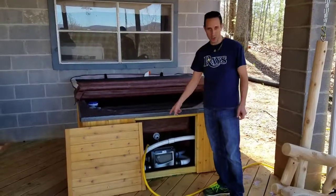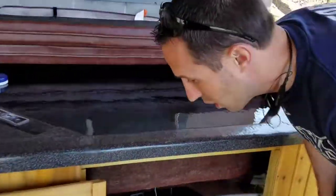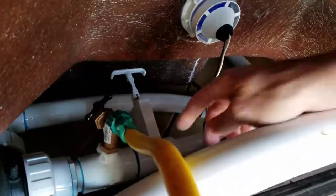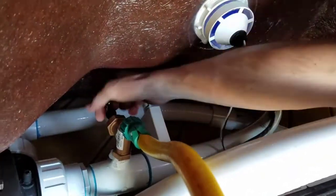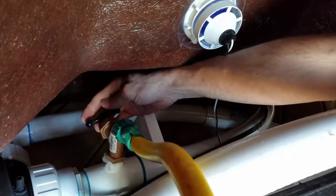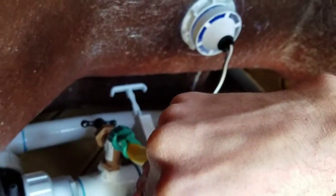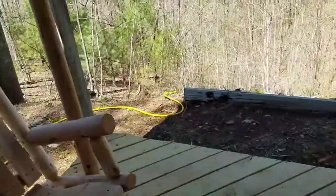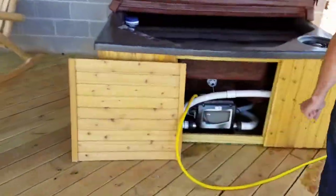We're not having to hook up the hose — I want to show you this since we took the time. So I accidentally overfilled it, which isn't good, but it's not as bad as being underfilled. I just screwed it on, went over the tab — that's to close it, and to the right would be to open it. You can hear the water running. One thing you'll want to make sure to do is put the end of the hose down the mountain so gravity assists and it's sucking the water out, because if that end isn't lower than this end, it won't come out at all.